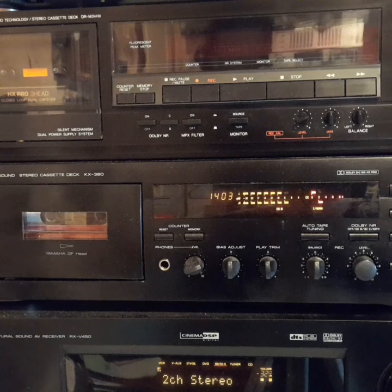The same advice, of course, applies to flutter, which is caused by shorter-term speed variations. It can be caused by a cassette, but is more likely to be caused by a damaged or worn capstan or idler wheel. Here's an exaggerated example. Notice how the music gets a harsh, rough quality with the flutter introduced.